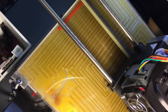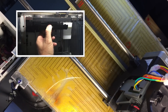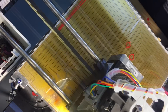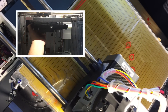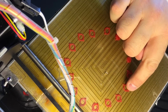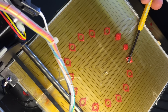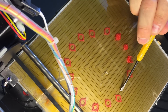Here's how I get there: I start the print, and when the extruder gets over the adjustment knob and I can see how wide the line is, I adjust the knob to get it to that 0.25 thickness. It's really just an eyeball adjustment, but it's not that hard to do. When it gets near the back adjustment knob, I do the same thing — I reach in and adjust it to get that same thickness in the back, and I'll do that again on the other knob. Here are the finished results after pausing it after the first layer. The 0.25 sections stick, and there's no glue — they're being held by the heated bed.